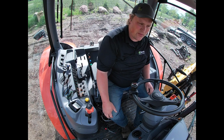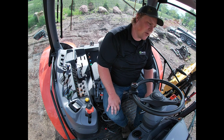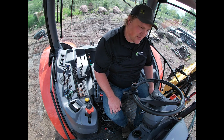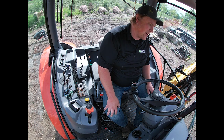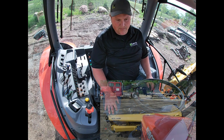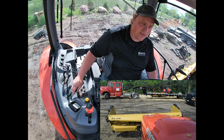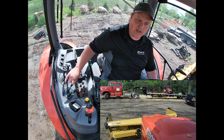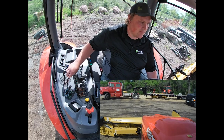So I wanted to give you guys an overview of what it looks like to run an AgriMax plow in a tractor — specifically a Kubota M6 101 tractor. This particular tractor is plumbed with four remote valves, so this plow is full hydraulic with no solenoid valve. The plow is up right now. You can see over here I've got my four levers: the way we have it plumbed is this one is your up and down, this one is your center mold board, and then we've got our left wing and our right wing.